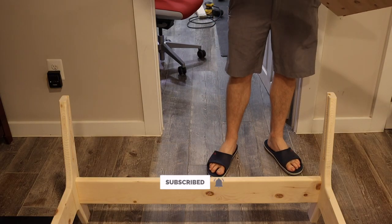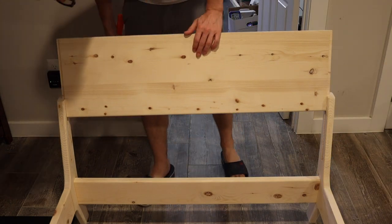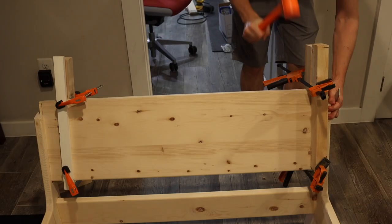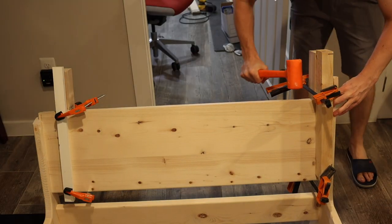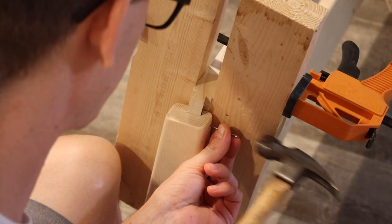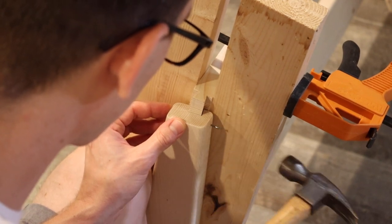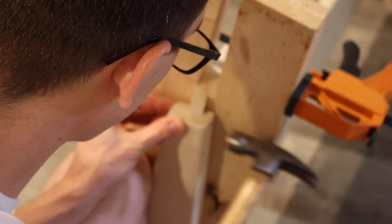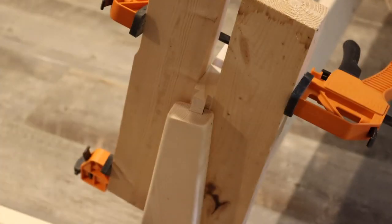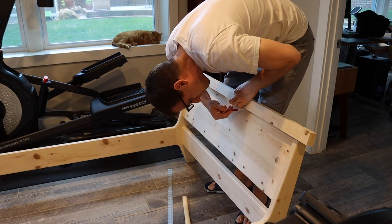Partway through I noticed a slight crack in one of the mortises — probably because the headboard was a little warped — so I clamped it with some supports to straighten it out, which worked pretty well. I was initially concerned it might crack when I took the clamps off, but there were no problems. Once I got it right where I wanted it, I drove in a thin finish nail at the top back on each side of the headboard, so only the bottom can move and expand and contract. This should solve the issue I saw in my first build where the top contracted and left an ugly gap — and I can confirm after a couple months it has not moved at all. I traced a line where I needed to cut the headboard flush, then used a hand saw to cut it away.